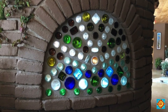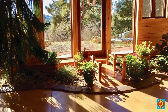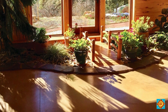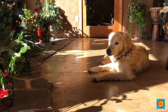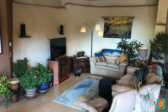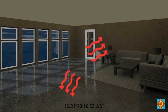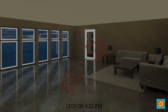You can add thermal mass with rock hearths, concrete floors, and thick earthen walls so the entire structure stores heat. In winter, sunlight floods the interior and spills across the floor creating long sun puddles — a concrete or thick tile floor soaks up this warmth and stores it. Even thick earthen walls not always in direct sunlight absorb heat collecting in the room during the day, storing it as the outdoor temperature begins to drop.